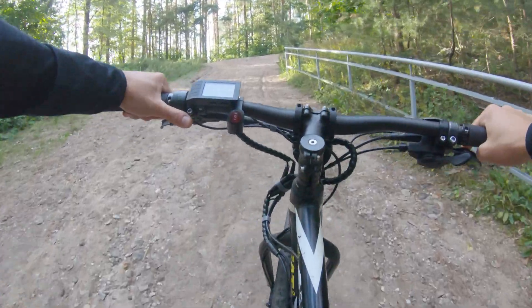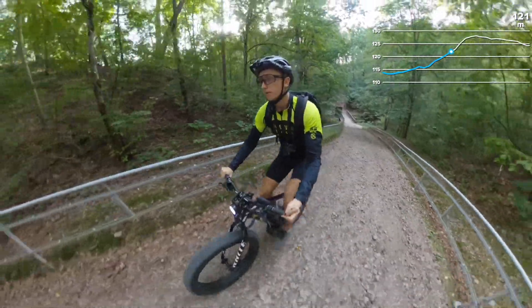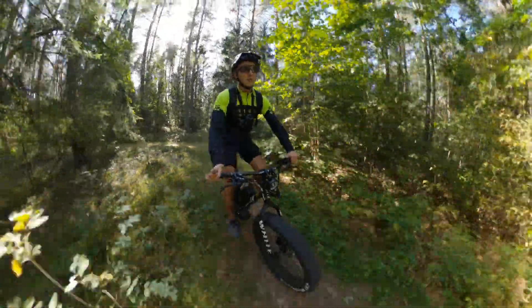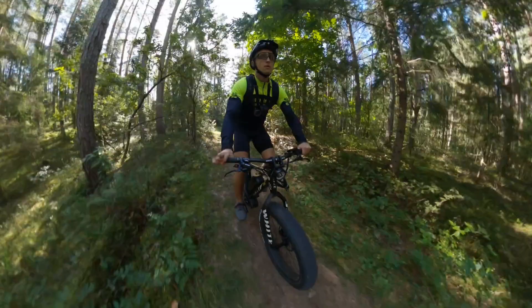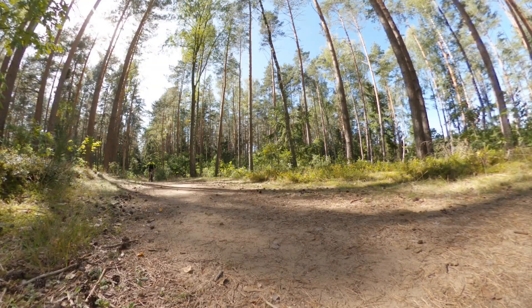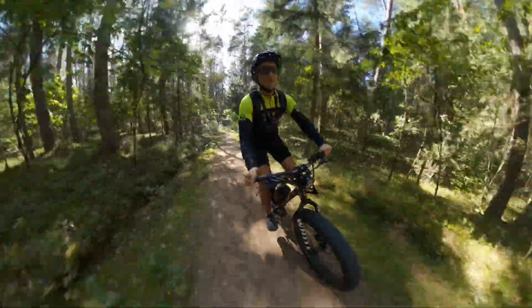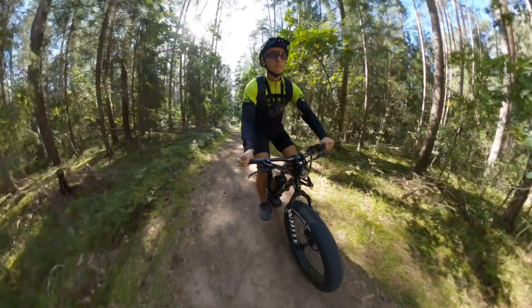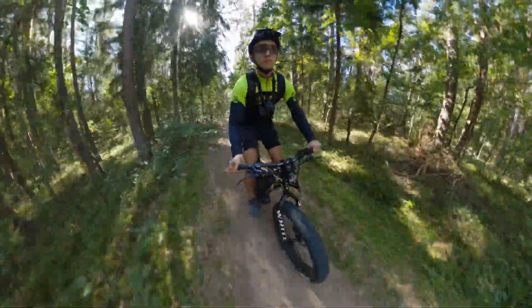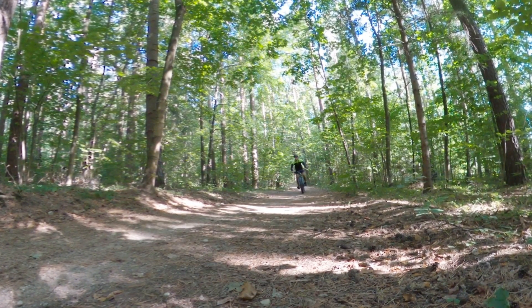The torque on this bike is just incredible. Rated at 160 Newton meters, it climbs up a hill with ease. The smaller the front chainring the higher the torque you will get, but even with a 48 tooth chainring I was able to climb up the steepest slopes I could find. Unlike rear wheel hub motors, the mid-drive motor sits under the bottom bracket at the bike's center of mass, so the e-bike feels more agile and easy to control without a heavy weight on the rear wheel.